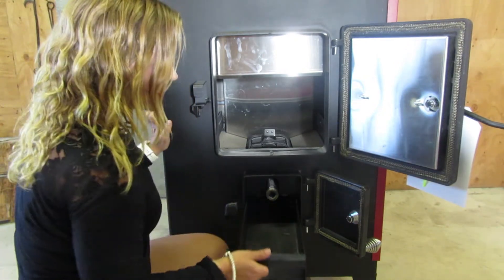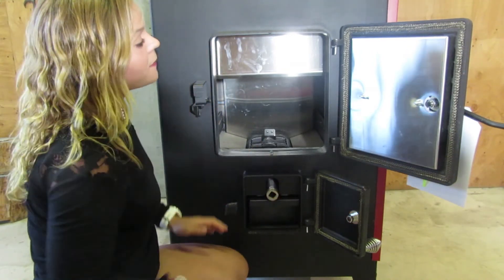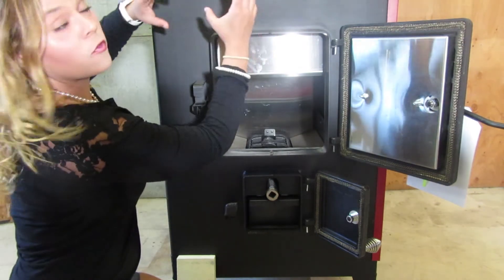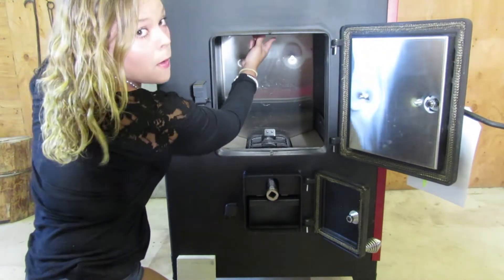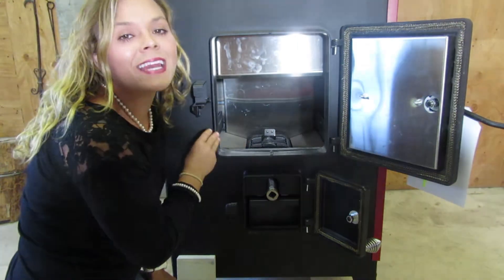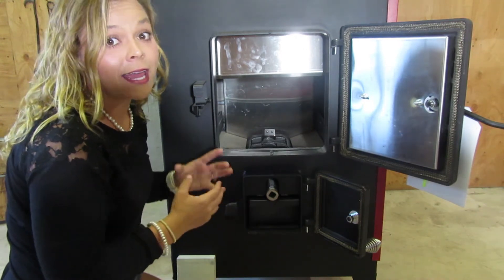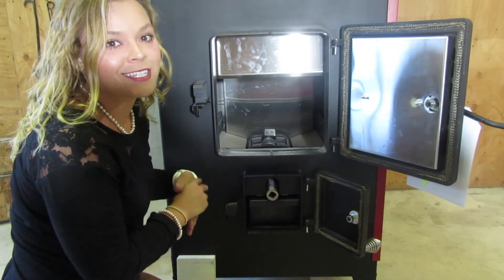Located directly below is the ash pan, so this is very easy maintenance. Another similar furnace that's no longer available on the market was the Napoleon, which had a dual vortex combustion system. What's cool about this Fire Chief is it's a super simple design. You have a bar which is your re-burn system that goes across the whole top of the firebox. This bar has three different areas of air holes — on each side and the top of the bar. This is basically like a triple vortex re-burn combustion system. I'm very excited to see this unit burn — I think it's going to be highly efficient.